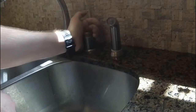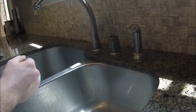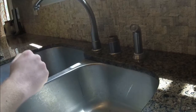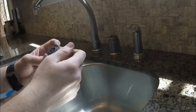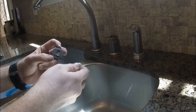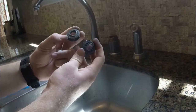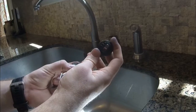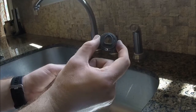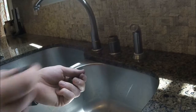Press the decorative collar all the way down — now you've got new O-rings there. With those two O-rings and the decorative collar in place, and the two spring-loaded O-rings in place on the hot and cold water ports, we want to rebuild the ball valve. The Delta kit came with two different plastic-grade discs: one with a more triangular cutout and one with a rectangular cutout. My faucet used the triangular cutout, so I'm not going to use the other one, but your faucet may.